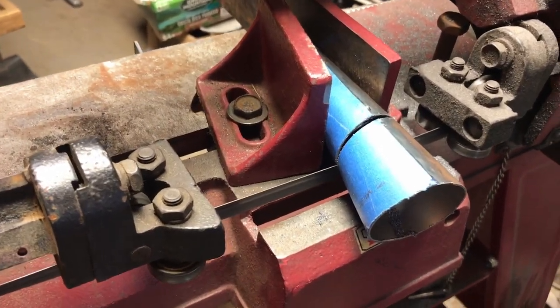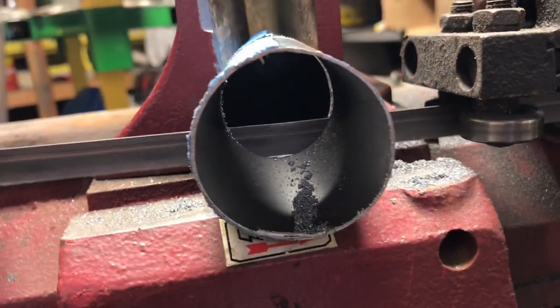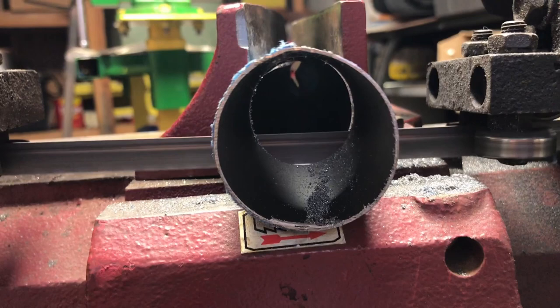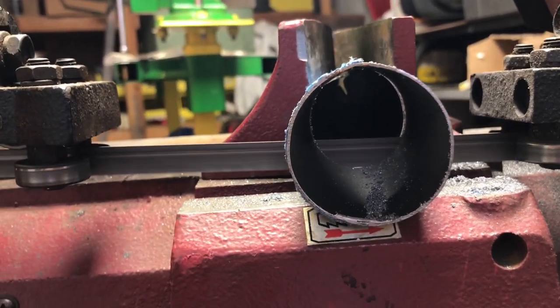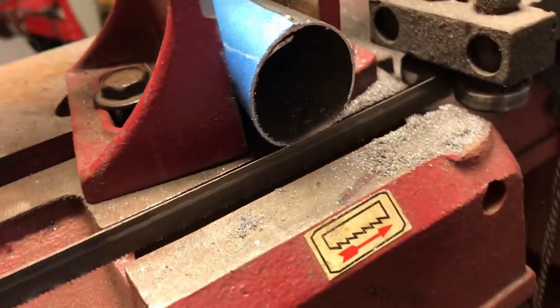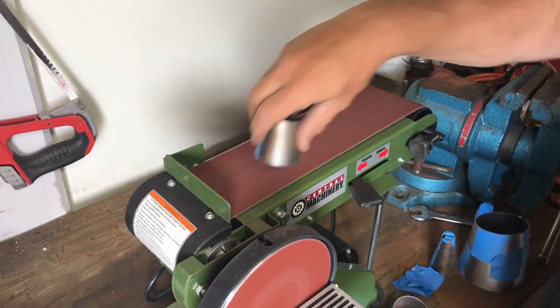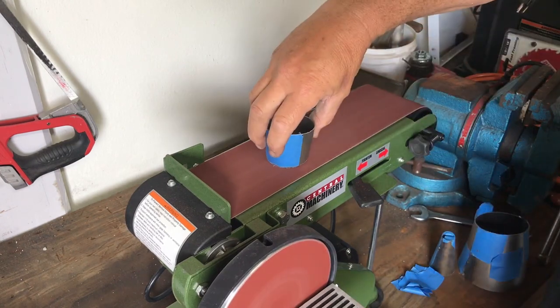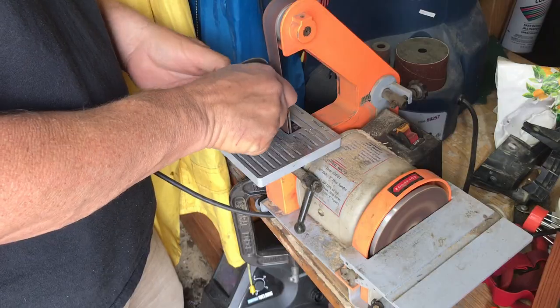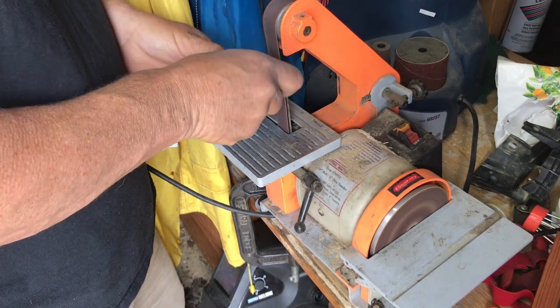In order to do so, we are creating pie cuts using the cones. This is done the same way as the first pipe in part two, by cutting the piece at small angles and stacking them back to back in order to create a bend. We approximated the final angle difference between the start and end of the conic part to be about 100 degrees, so we made 10 cuts at 5 degrees each, since stacking each piece back to back will double the angle of the cut.